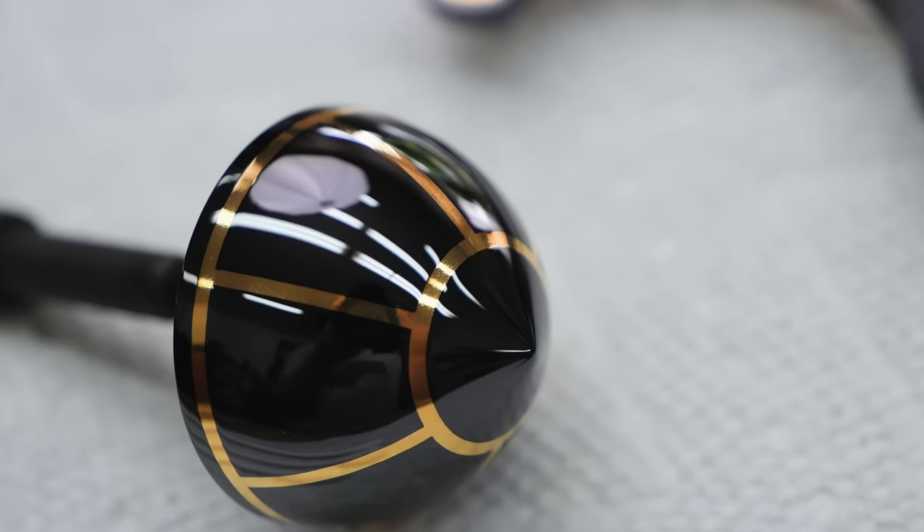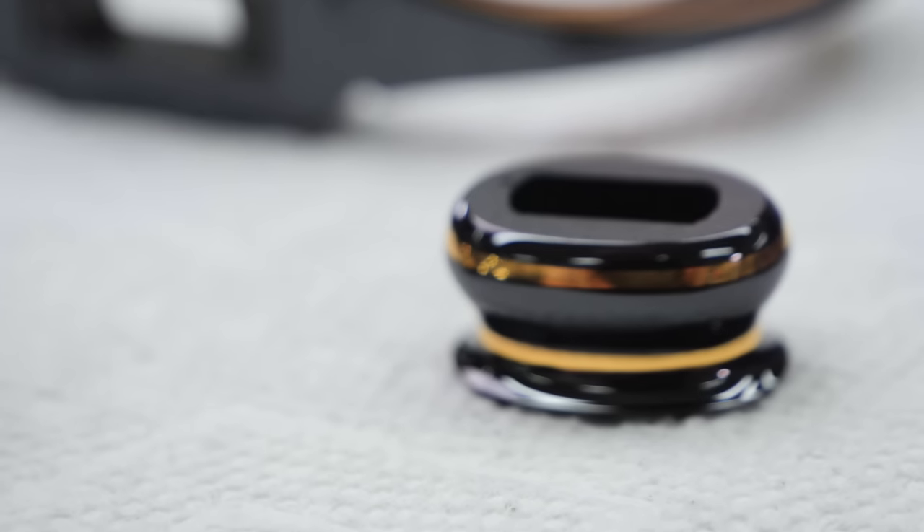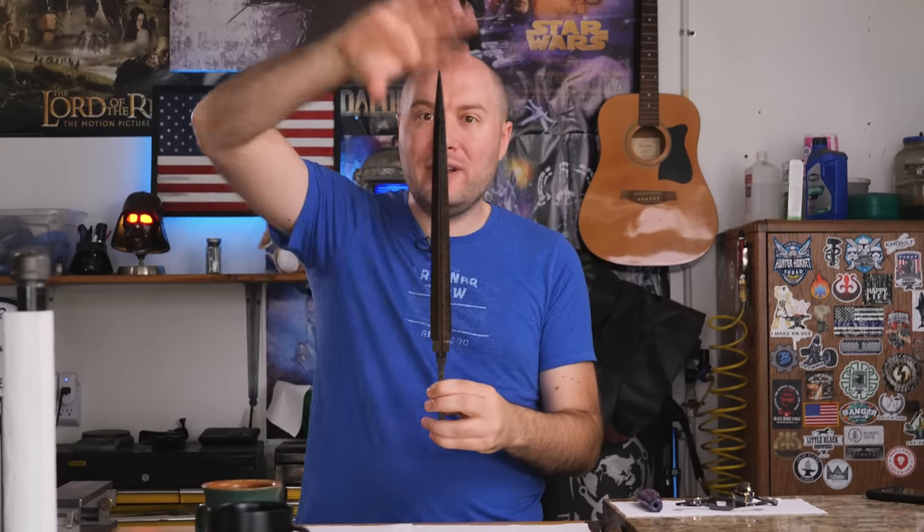It's the next day and I just finished getting all the oils removed from the parts and doing the final inspection. The bluing came out beautifully — I couldn't have asked for it to come out any better. It looks so even, so jet black — a beautiful dark mirror finish on the pieces. I cannot wait to get this knife together. We have one more thing we need to do before the final assembly, and that is to sharpen this dagger. Right now there's probably about a five or ten thousandths of an inch flat spot on the edge, so it's not actually sharp. For this to be a functional piece of art I've got to get it hair-popping sharp. It's going to be a lot of work though, because this is a narrow dagger with a really long blade — lots of edge to sharpen — and the bevels are ground at a pretty aggressive angle, which means I'll have to sharpen at an even more aggressive angle.